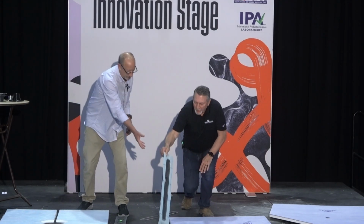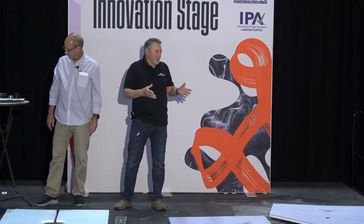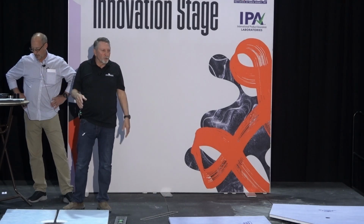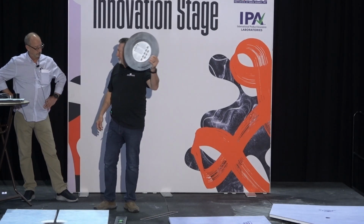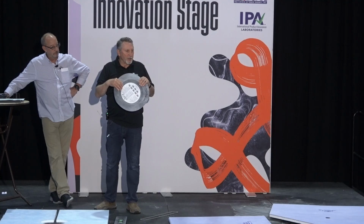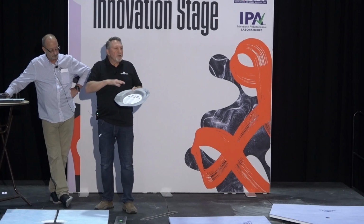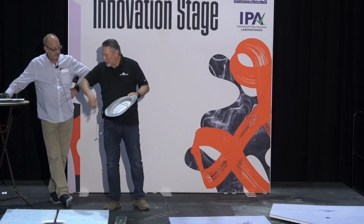So we also offer this base as drains by others, okay? If you have a 3-piece clamping ring drain, it's made for a mud bed. We have what we call our commercial version. A lot of you are familiar with our NobleFlex drain flashing that we've had forever. It transitions from the top of a thin bed method down to a clamping ring drain, and then you just put your weep protector in and fill this with dry pack mortar, and you transition that to a 3-piece clamping ring drain. They call that in the industry the divot method. People years ago used to use a frying pan to make that divot.